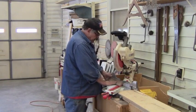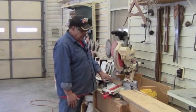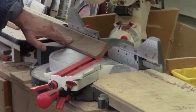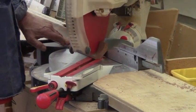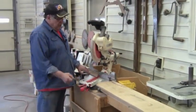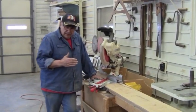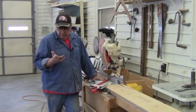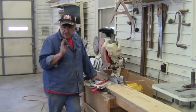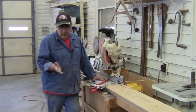The easiest way I've ever found is just set your crown up against your fence exactly like it's going to sit on the ceiling, or on a piece of furniture or whatever. Make a plunge cut, you've got it. Now, here's a trick. Because saw blades can sometimes give you a little shimmy, particularly if you're cutting something hard and heavy, I'll cut it, leave it about a 16th of an inch long, and then just barely shave it. That sneak up on it thing.